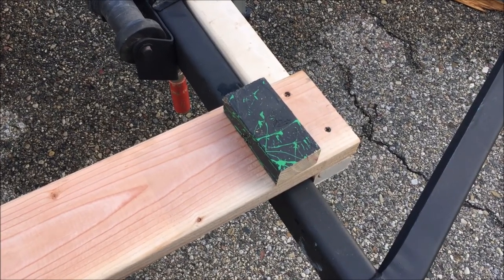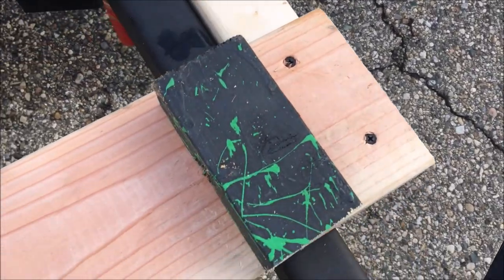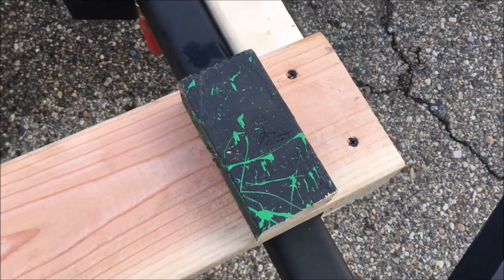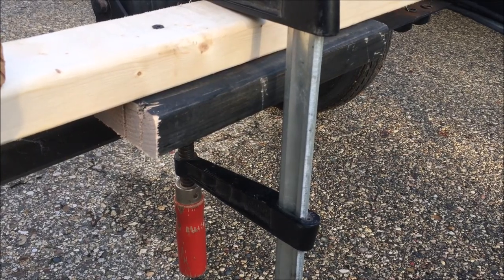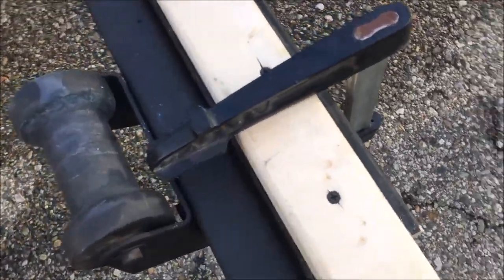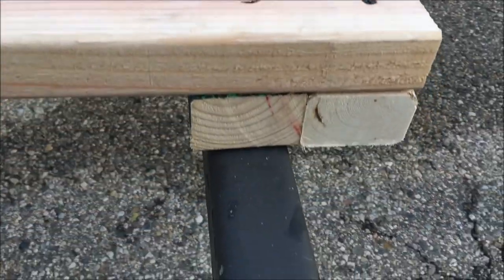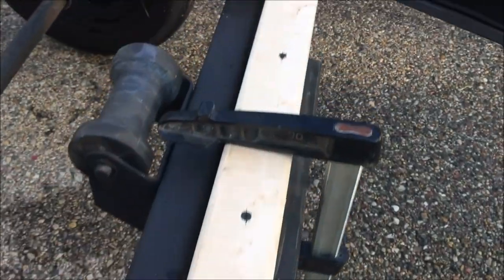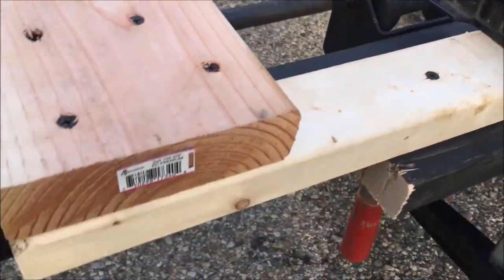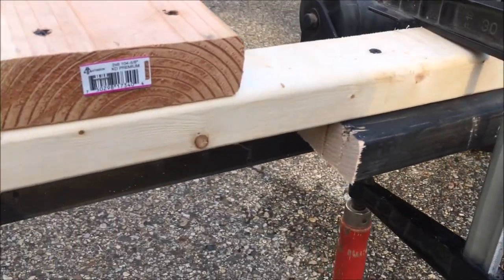To make the height of the front and rear the same, I cut a couple pieces of 2x3 by 5 inches long, let the clamp loose, and put these little boards under those 2x6s and screwed them in place. My final piece of wood was a 12-inch 2x4, just to square the assembly up when it's in the down position. I kind of engineered as I went — I did this one a little different than the ones I've made over the last ten years, but I think it'll be fine.